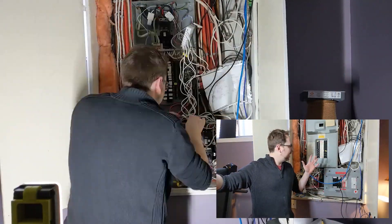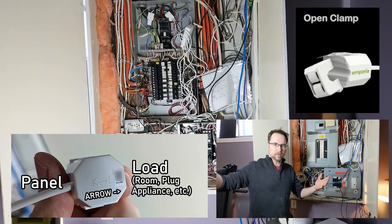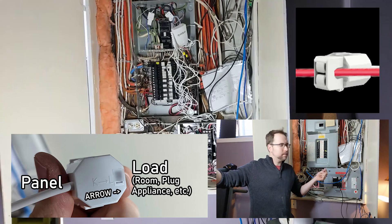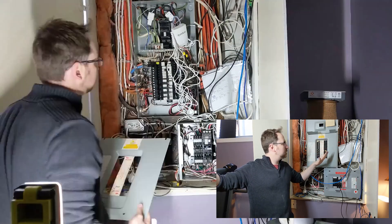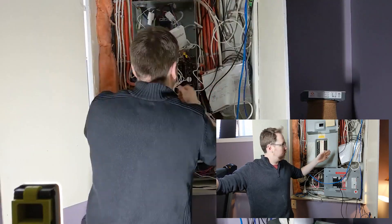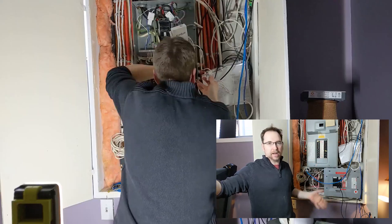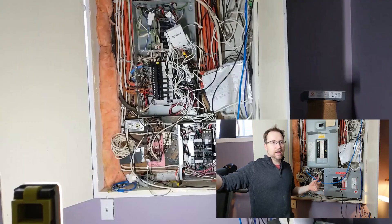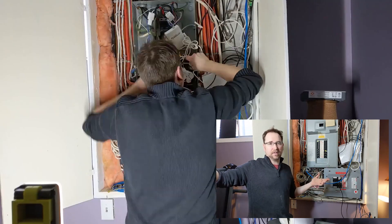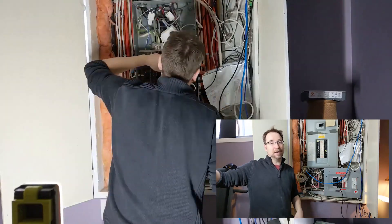Also, make sure when hooking up those 50-amp individual monitors, take the time to route the wires one at a time as you install them — run them behind the existing wiring or create a channel. I didn't do that, and it became a big mess. Going back to fix it after the fact is too much work, so I strongly recommend routing as you go.